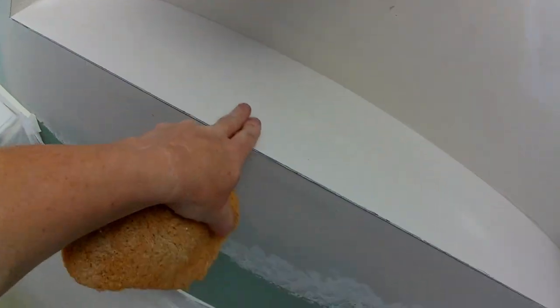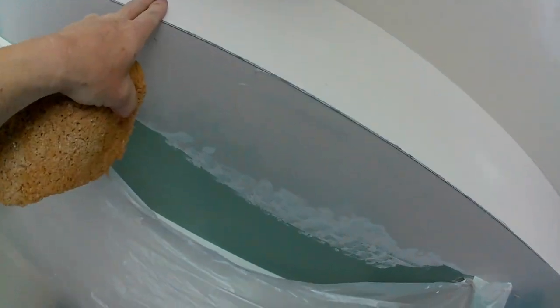This is the process done with only hot muds. It's called the slick out technique. On my channel, I have several videos and all my patch jobs where I use hot muds, 5 minutes and stuff like that. So once the mud starts setting up like that, it's not totally wet, but it's not totally dry. You got to work the mud now.